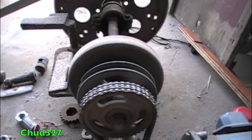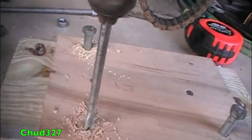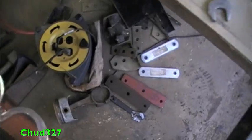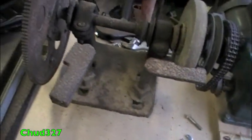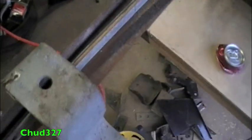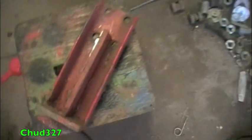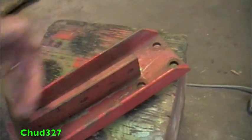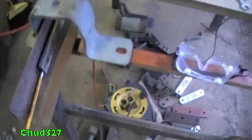I'm going to take all this and bolt it up on that table. So far I've got the motor mounted to the table and the grinder device is sitting in place. I'm using these for my connecting rods and I'm going to make a trough out of this three-inch angle iron. Another piece cut off, have it come up on this side, and down here this is going to be my sled crusher — I'm going to weld this to the center. The connecting rod goes here; this is what goes back and forth inside the trough. I'll put an end on it, cut a little groove out, and we'll be crushing some cans.